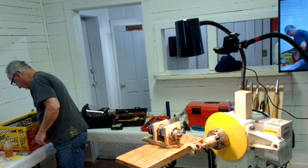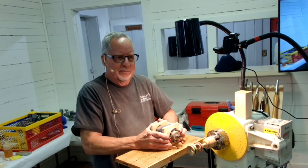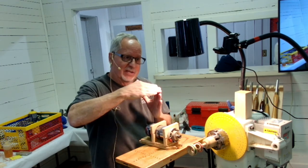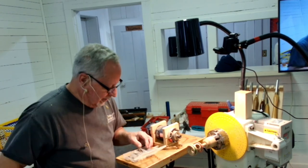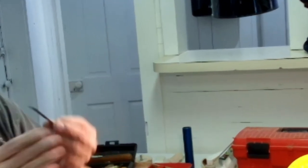The one problem I did run into in cutting V-jigs is apparently the router must move almost imperceptibly as I cut them, and so the hole is never 90 degrees, even though the cutter is 90 degrees. It'll be like 87, 88. I didn't show you that. Should have. So what I made was this little jig right there, and it says it is 93 degrees. So what I do is I'll set up my table saw, and I'll cut those blocks of wood that go into that at 93 degrees instead of 90. And so now they fit down that V groove perfectly.